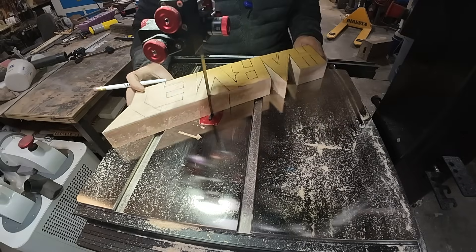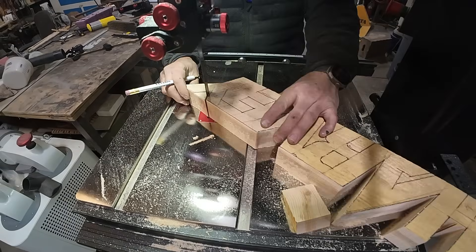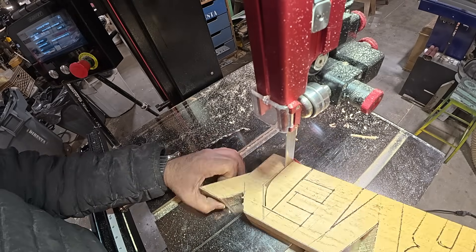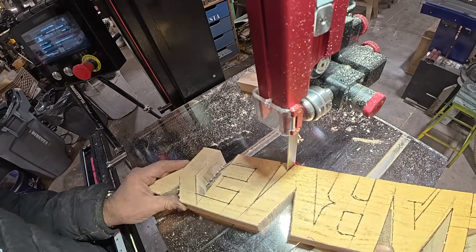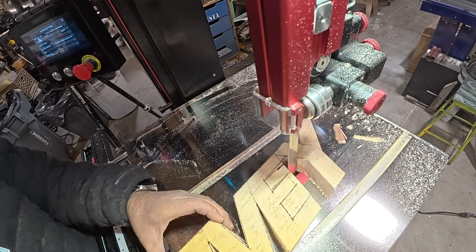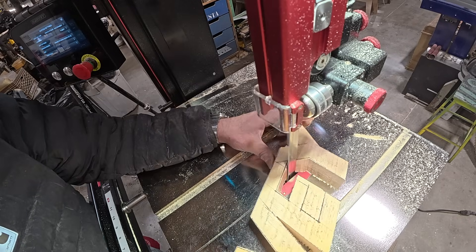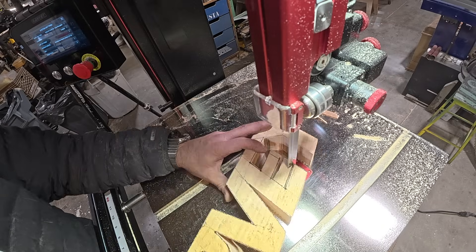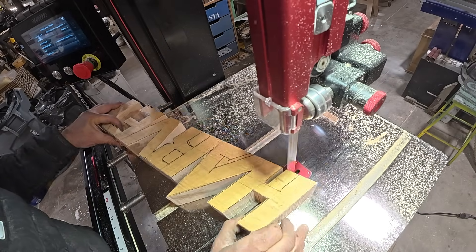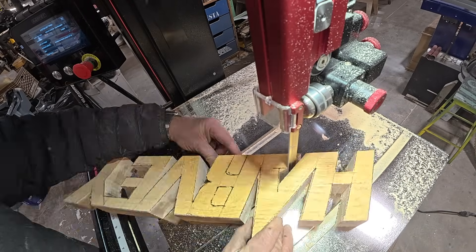I used a straight edge to clean up my hand lettering. Now with a big thick blade like this, I try to just knock out all the big stuff straight away. Since this had such an aggressive tooth — maybe four teeth per inch for re-sawing — I was able to use the front of that tooth the way a chainsaw sculptor would, cutting sideways, nibbling away inside. Whenever I have a Sharpie line on a letter form, as long as I keep the Sharpie line for 90% of it, that's my safety zone.